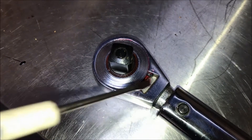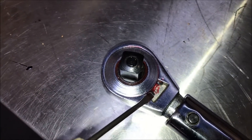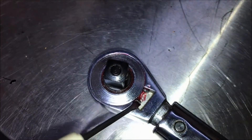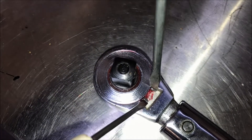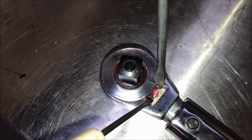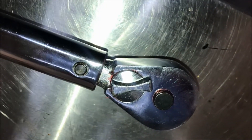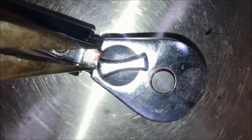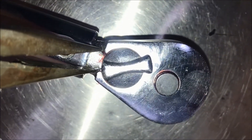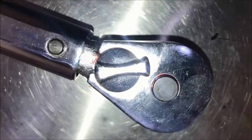To open up the mechanism, there are two c-clips of similar design. I used two screwdrivers — one on this side, one on this side — pushed them together, which compressed the c-clip, and I was able to pull the whole assembly out. On the opposite side, I simply used a pair of needle-nose pliers to pull the c-clip together, compressed it completely, and with my hand pulling up on the selector switch, pulled the whole thing out.